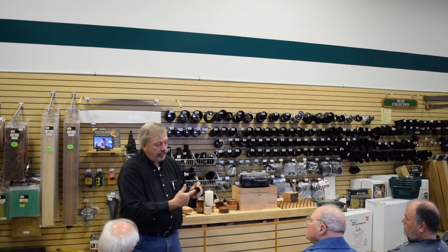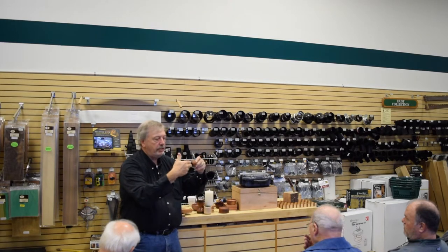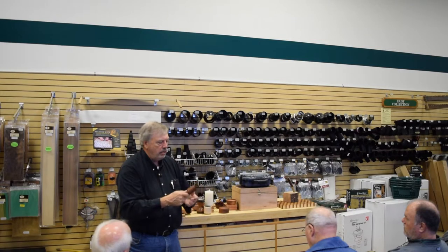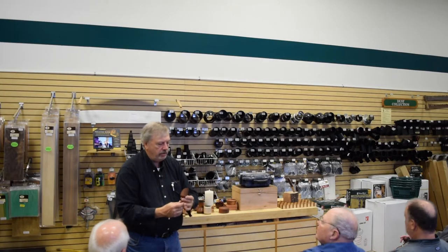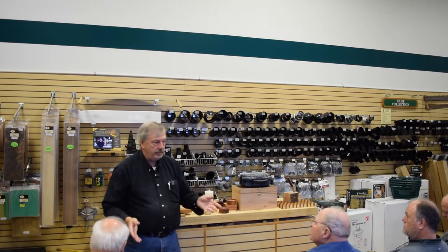This is the very last thing you do: cut this on a bandsaw. So this is out here, the 60-degree center is in here, and you're turning. This is all spindle turning. Sand and everything. And the very last thing to do when you're done is I have a little V-block that sits in, and I take it to my bandsaw, and I just give it that turn, and voila, you've got a little scoop. You can make those all kinds of sizes.